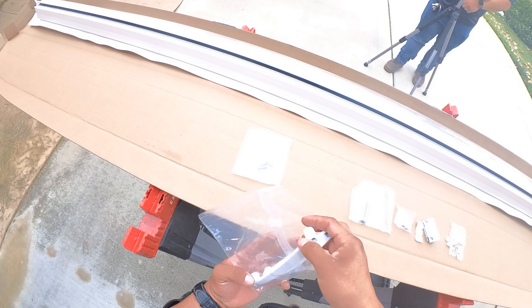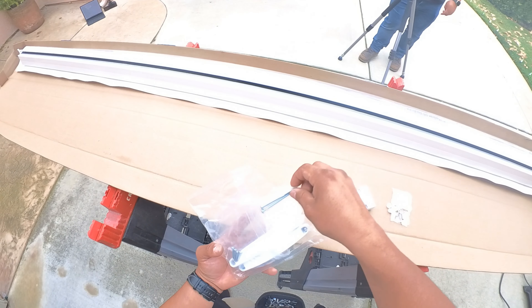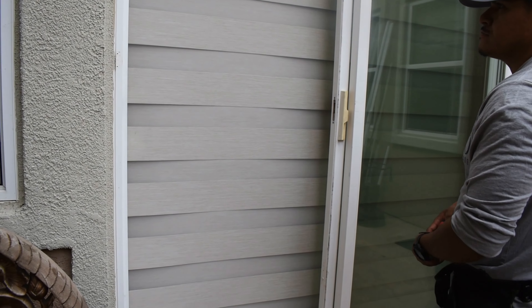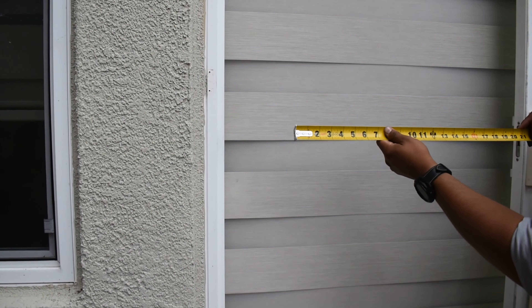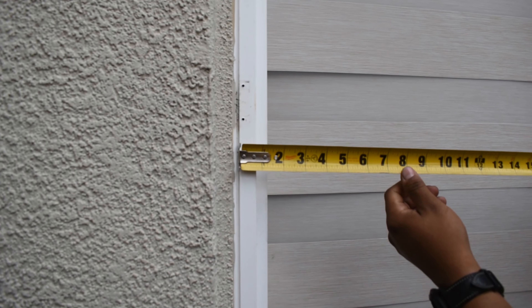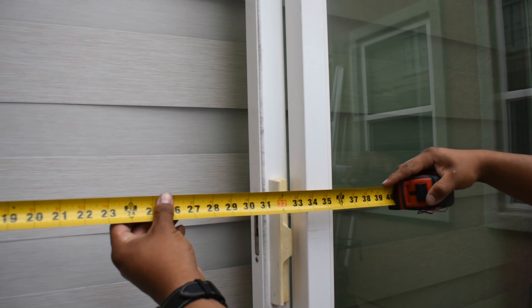You won't need these right away — it is probably best to store them in your tool belt for efficiency. Vinyl sliders are typically so easy to install there are no sill adapters, so the only measurement you will need is for the rails. You want to measure from the outside of the slider to inside of the center post.